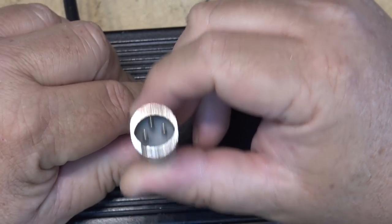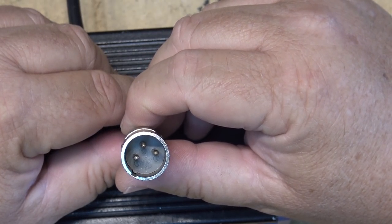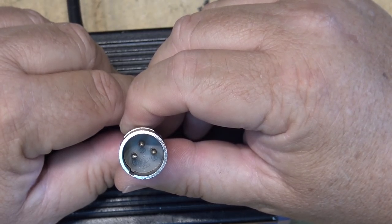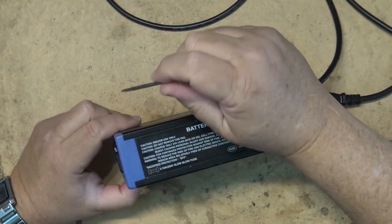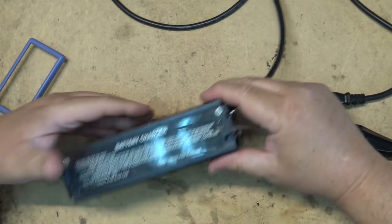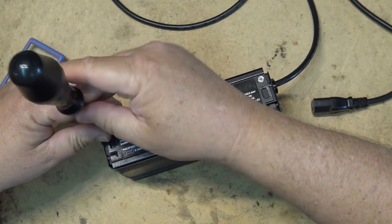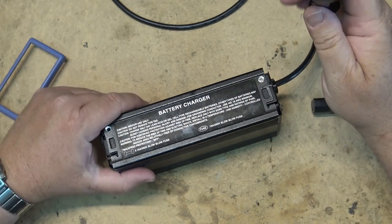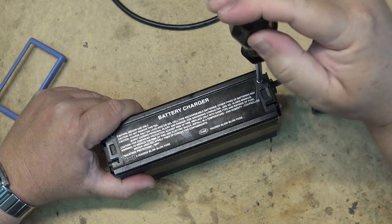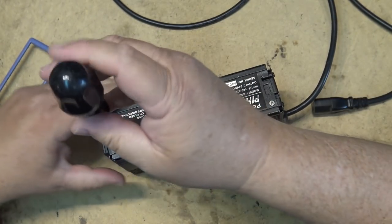I really love how they just use a standard XLR microphone connector — a Canon XLR, three-pin — like you'd think they would use a four-pin like broadcast cameras use for power, so that some dumb ass doesn't mistakenly plug it into something not expecting 24 volts and blow it up. First things first, let's figure out how to open this thing up. I think the ends probably come off — which they do — to reveal some screws. Looks like there's two fuses in this thing: a 3.15 amp slow blow and a 10 amp slow blow fuse.